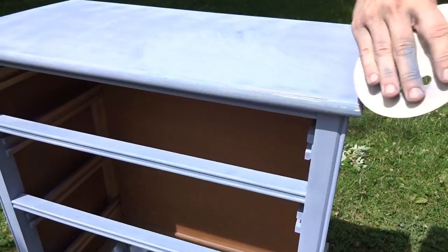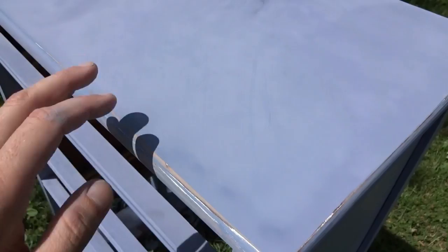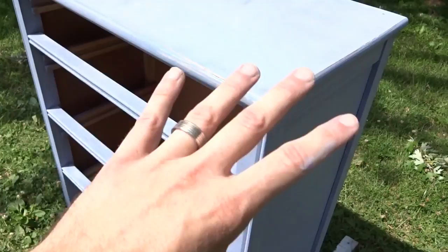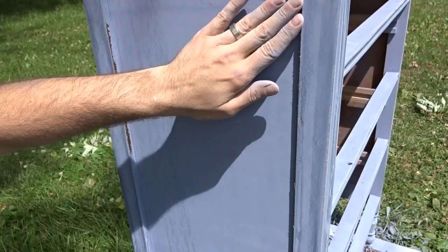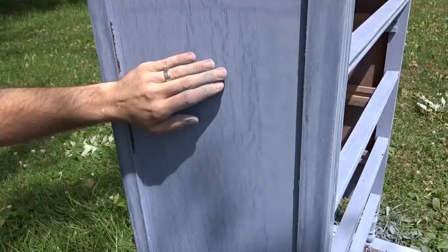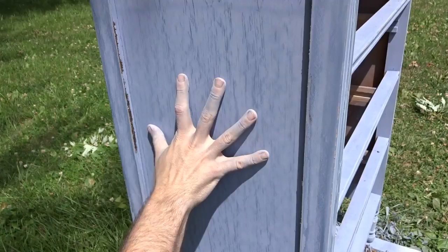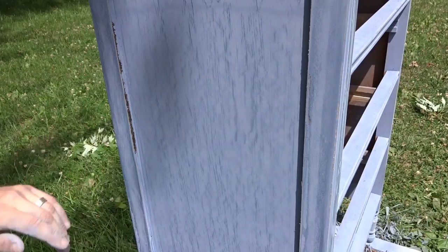Here's what the scraping and sandpaper distressed job looks like — this is more the look I was going for. The flat areas I'll just kind of leave alone and smooth them out a little bit, but the corners I'll do like this. After going over all the corners with the sandpaper, I decided to add a little dimension to the flat areas too. I'm just taking my scraper and running it down flat — it's hitting all the little high spots of the wood grain and making them pop out. I think it'll still show up after the wax. Pretty cool little trick.